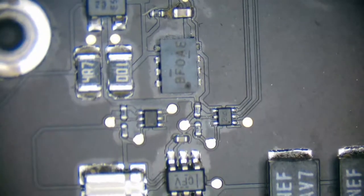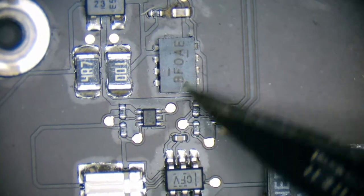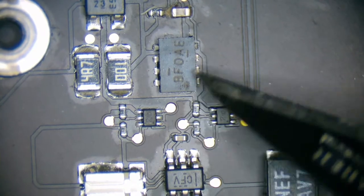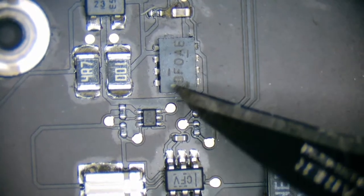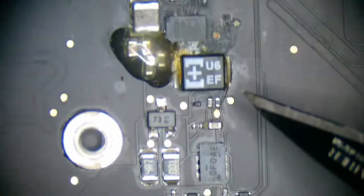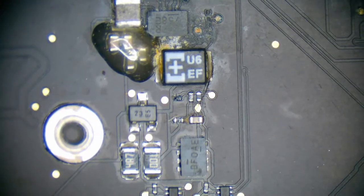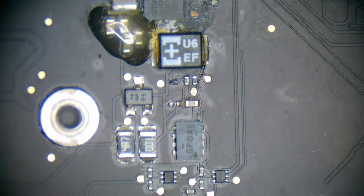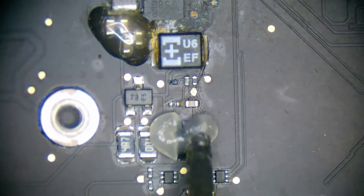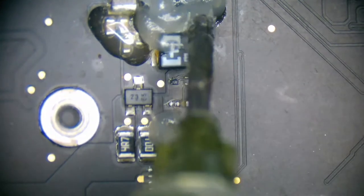In fact, bam, you can see all. Actually, wait, hold on. It looks like a hole. That's a hole. That is our Q7010. So that's definitely the reason why it's not sending PPDC in to create our PP bus. So let's replace that, as well as just replace all of this mess right here. All of it.